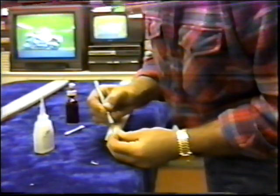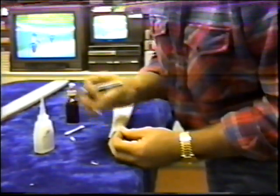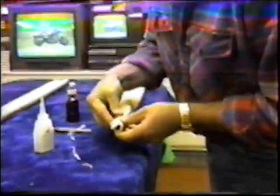Again, this is nothing fancy. Make a V-notch just so I can join these pieces as close as possible. This is all going to get final sanded out anyway in the final product. See, now I've tried to V-notch that out so I can just get this to join together. And there's so much material here, of course it's 1/8 inch, I can just recontour it out. Also, you see the little indentations from having this on the mold? Well, we're going to sand them all out later. That'll be easy to do. That's just typical when you have relatively soft wood. But getting these joints all joined together before we actually go and make the trim, it's important. Otherwise, this might not be accurate.